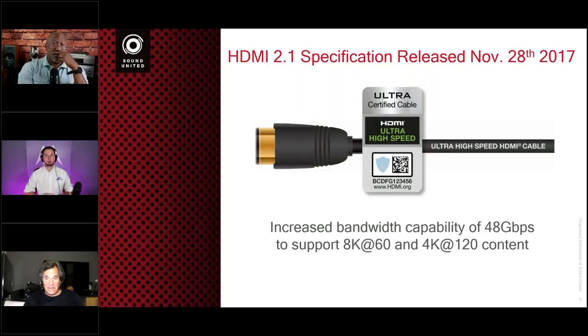And we had to put these things together in a way that integrators could understand, not engineers. So this is a translation of an engineering document from HDMI done by a mix of engineers and real world people like Jason and myself to make it accessible to a guy whose customer tells him, I swear, I had HDR coming out of my Apple TV yesterday. Where'd it go? And that's a real world scenario, and it's going to be EDID based, and someone's going to have to fix it because you don't want to be running that truck back to the customer's house so many times. It's got to be fixed. It's got to be diagnosed. And more importantly, it should have been designed right to begin with.